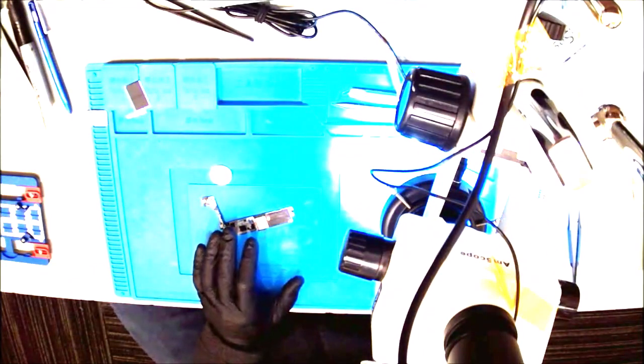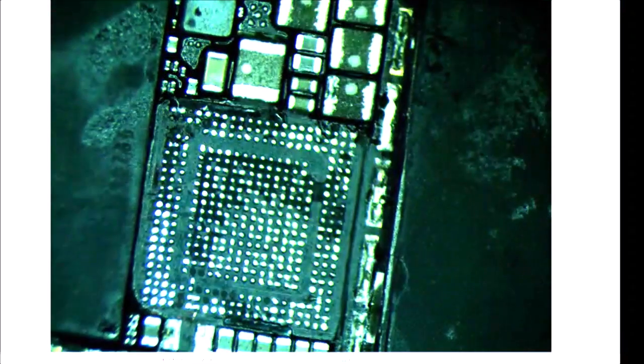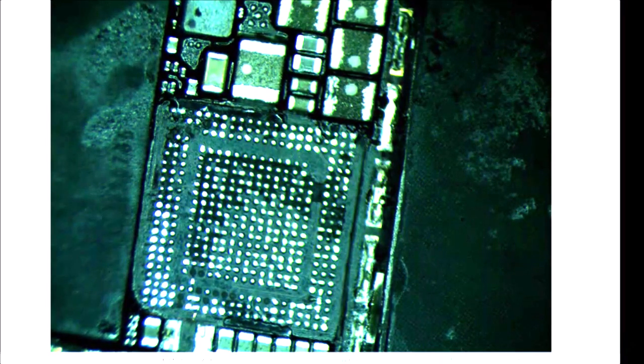All right, that feels cool enough. Let's go back under and check. All right, that's our line in question. It has been giving us funky readings this whole time. So there is our guy. And now I'm getting OL. Because it's obviously an open line. God dang it, I'm telling you, I think that was my problem. Oh, what a nightmare. What a freaking nightmare.